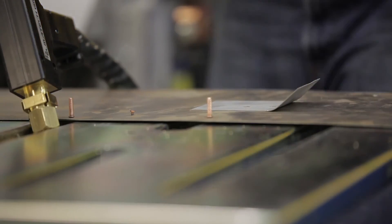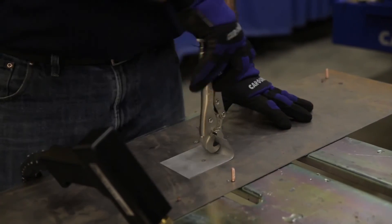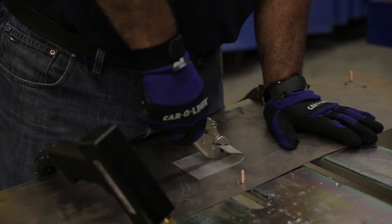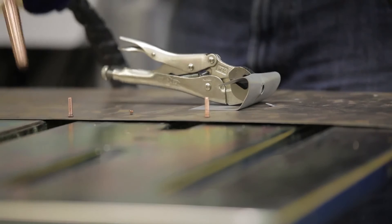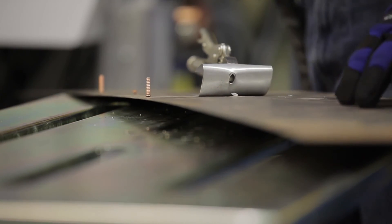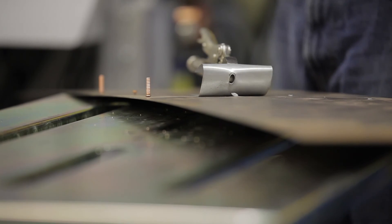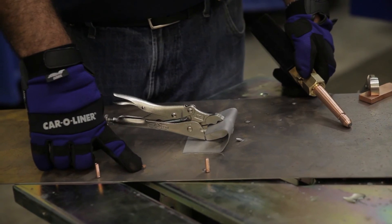We'll try to do now what's known as a standard industry destructive test, or a peel test, to see for metal tear out to confirm it's a sufficient weld. If we turn the workpiece towards the camera, you can see that we've ripped sufficient tear out — not quite as much as you would get from a two-sided weld, but plenty sufficient for a non-structural or cosmetic repair.